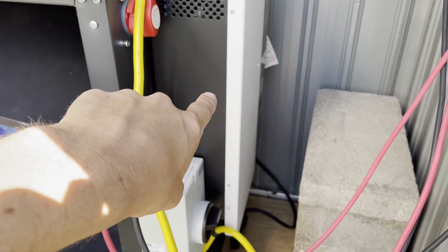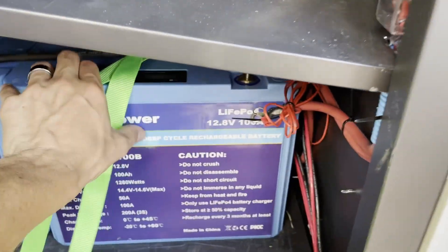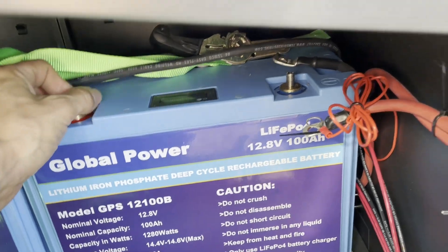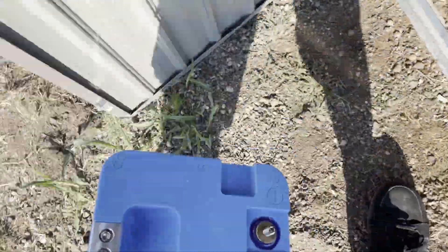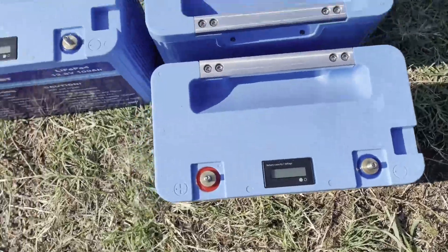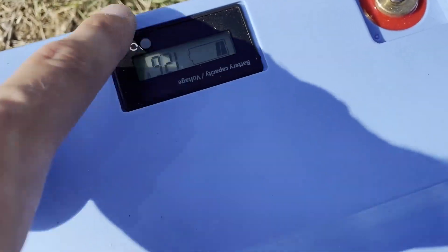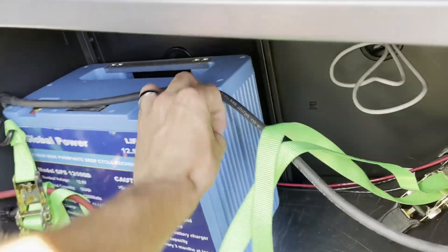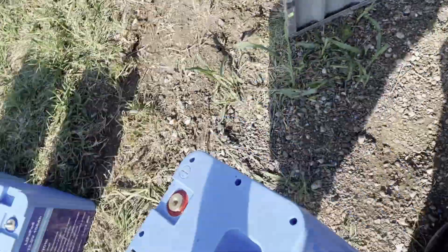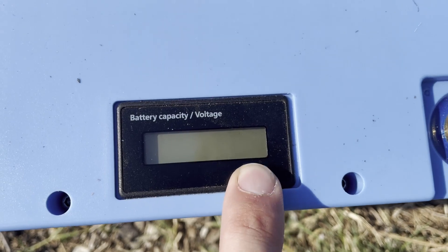So I want to look at that later, but right now I'm ripping these two batteries out and going to put some different 12 volt batteries in series along with the 48 volt balancer, to get this thing back online so his well pump is pumping and him and his son have water again — because that's important right now. This is what we're working with: one of the Growatt 3000 LVM ES's over here, another one on the other side, and I've got the four batteries coming out. One of them shows nothing — it's just dead completely.